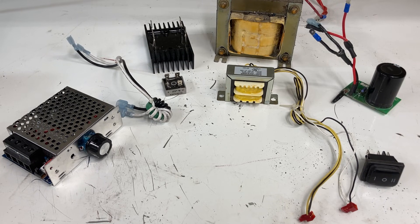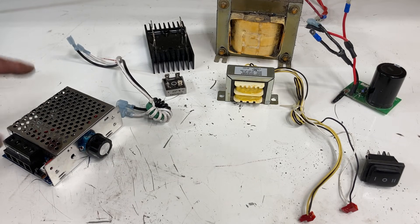We start with the SCR voltage controller. This is a device that basically switches off and on really fast, takes AC current and steps it down to a lower voltage. Not all SCR voltage controllers are created equally — a lot of the ones out there run kind of poorly. I've seen videos where people complained about them burning up treadmill motors or causing a rough bump start. But if you set them up correctly they can work extremely well. A unit like this can be purchased for about $30 from Amazon.